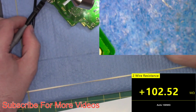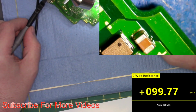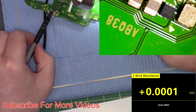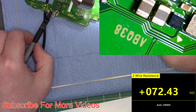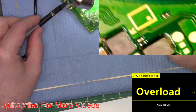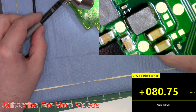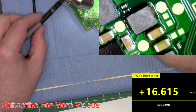And then here there is another inductor, 2 capacitors, and a diode. That's going to be another power supply. Right over here is an inductor and another power supply for whatever this chip is. Probably another low voltage. But if you go back to the area in question, you have an inductor. So you basically have probably 5 voltage regulation circuits here.